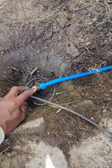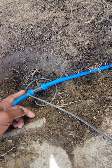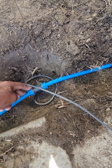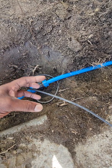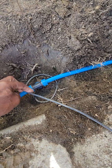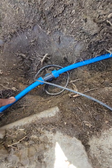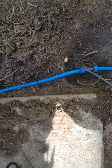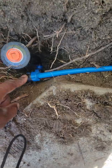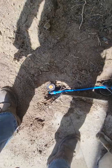We have a fitting — a coupling down there, a threaded coupling — and we put on a Blue Lock T. These are pressure clamp fittings, kind of like a SharkBite type of situation where you push the pipe in and the water pressure, once it builds up, holds onto that piping. There's an O-ring gasket in there that seals off the pipe so it doesn't leak. Then we run our half-inch blue pipe piping down — it's already secured in the ground with a staple — and there are some different fittings in order to get the configuration needed to get that pop-up positioned properly.